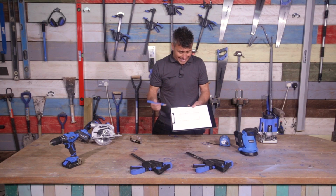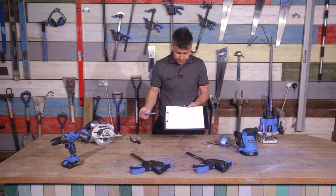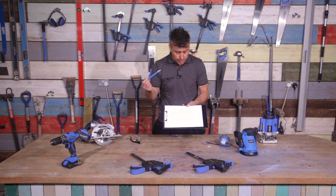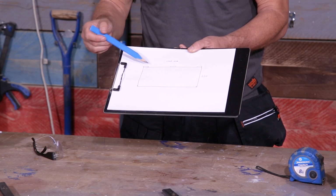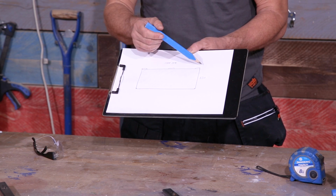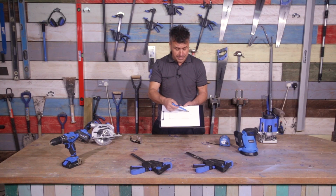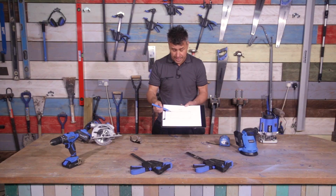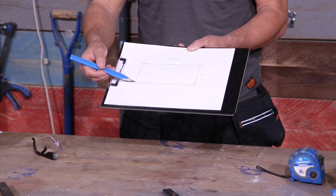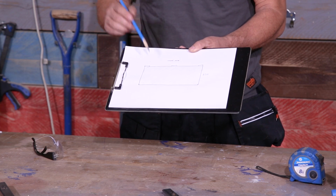So my foldaway desk is going to be 1000 millimeters, 1 meter in length and 650 millimeters wide. It's going to be hinged at the back. You've got the option of using 3 standard door hinges, which are 100 millimeters wide, or you can use one continuous piano hinge. I'm going to be using 18 millimeters MDF sheet, and I'm going to use my router to bevel just a soft edge around 3 sides, both top and bottom of the desk. It doesn't need to be along the back.